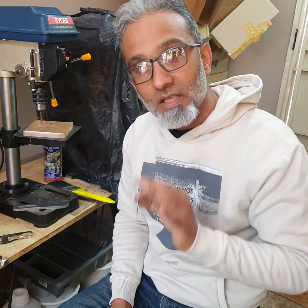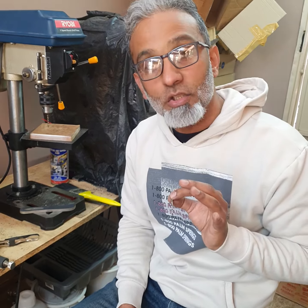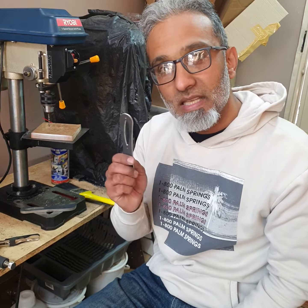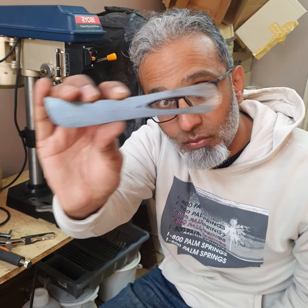The main thing is to use the correct speed. On our website under knife resources, I've got a drill speed guide — the smaller the bit, the faster your drill needs to go. I use the tool steel guide since that's closest to what we use in our knives. First, drill one of the blades with pilot holes.